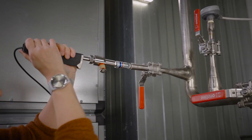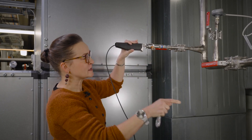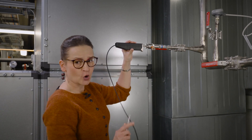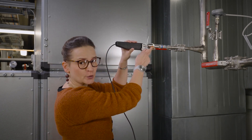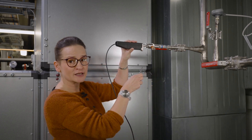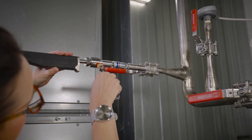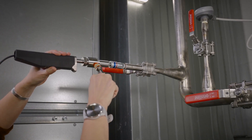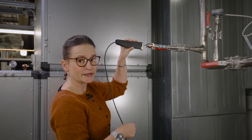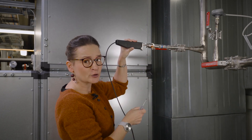The probe can be simply assembled and then the valve needs to be opened. This is a dead end of the pipe, so there is no airflow to the probe head. That can be fixed by adjusting the leak screw. The guidance is to first fully tighten it so it's closed and there's no airflow, then open it about half a turn. When you open it, you can hear a small hissing sound of airflow, meaning there is now sufficient airflow around the sensor — guaranteeing the measurement reflects the air directed to the process, not what is in the dead end of the piping.